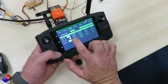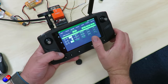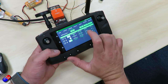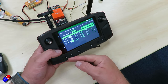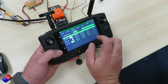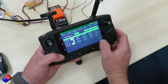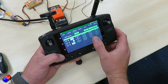So we've got toggle, momentary, or default button types. This button menu can become quite powerful — we can map multiple buttons onto the same channel. We can actually map six flight modes this way by using a combination of short and long presses and just adding buttons to the same channel. These are SBUS buttons, so this doesn't have to have an app open. Whereas MAVLink buttons are sent from within an app — that's the key difference between the two methods.